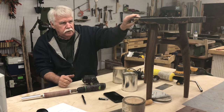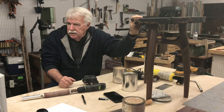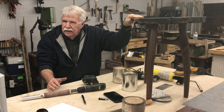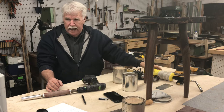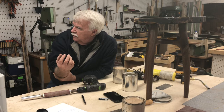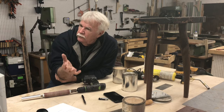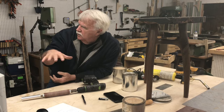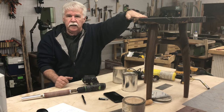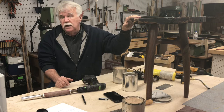The first thing I did was wire brush the whole thing — the live edge especially — with a heavy steel wire brush, then sanded to 120 to give me a starting place. I've never done this before. Then I got my MAPP gas torch and just torched it. I actually charred the top layer of the walnut — you could see a little alligatoring. Then after that I sanded the heck out of it back with 120. I was a little concerned the soot would come off, but I sanded down to 400 after all that and then put the oil on.